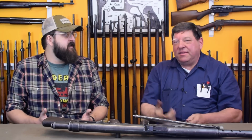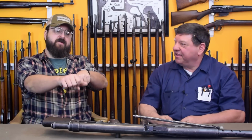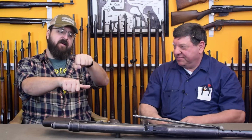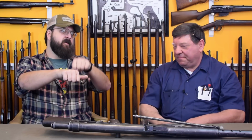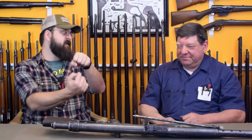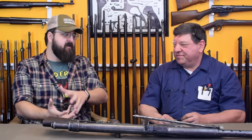And by the way, the Madsen is among the worst at clearing jams. That's something that we didn't talk very clearly about in the actual Project Lightning. It has to be taken apart with your index fingers, and you do not have enough power in your index fingers to clear that malfunction, with that whole big breech block there never quite coming out of the way. At best, you have to disassemble most of the gun to get the breech block up, and then in and under to pull the cartridge out, and then you can't lever on it too strongly because you'll snap other things at the lower assembly.